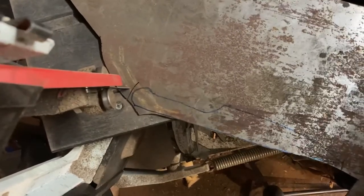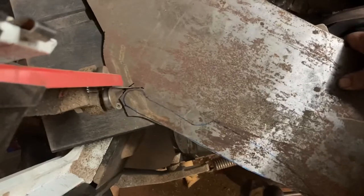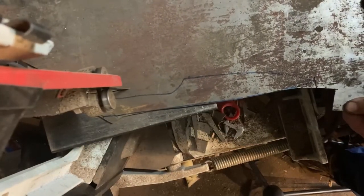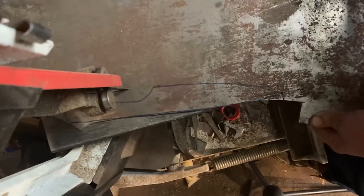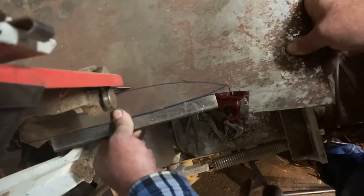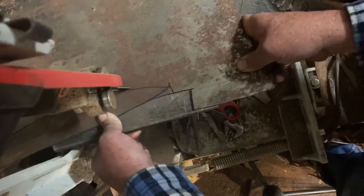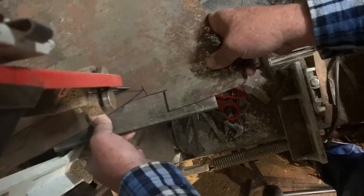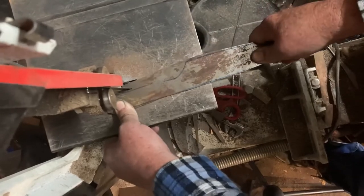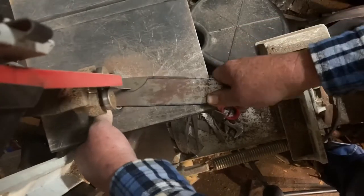As close as possible I'll follow the contours of the knife so I don't waste any steel and also to leave me less grinding. It is a wee bit hard to try and get into the curves, but we'll follow around as best we can and cut to the basic shape we're after. Once we've got the basic shape, I'll come back through and cut into the handle to get a little bit closer and reduce grinding.